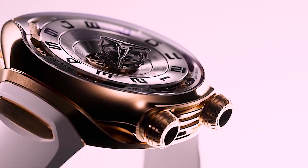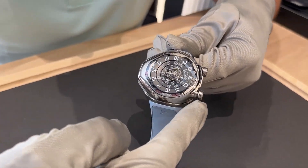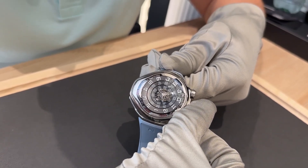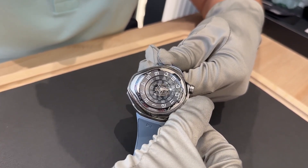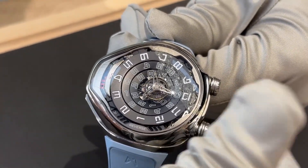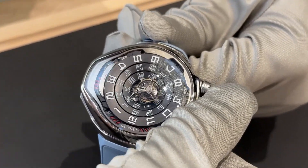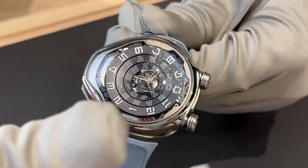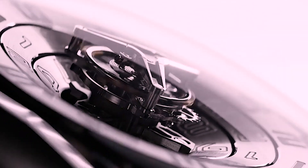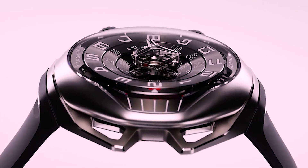And if I keep going here, I will use the crown as a joystick — it's a mechanical joystick. I will turn it 60 degrees and hold it, and all the dial will move. I can also go backward. I can do a little pinch like this to make minus one, or hold it and go forward again. So we don't use it as a crown on a usual watch where you turn it several times. You just turn it 60 degrees forward or backward to set the time.